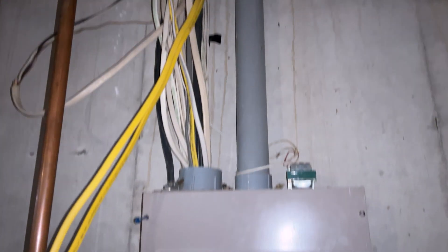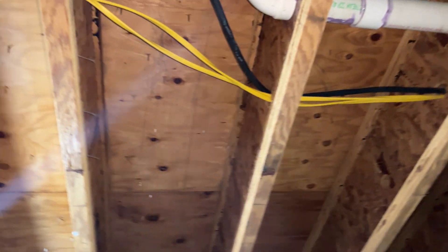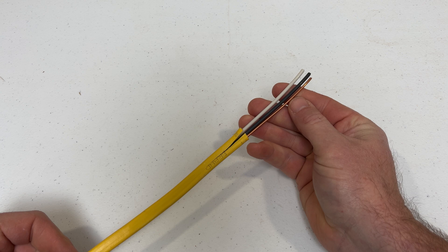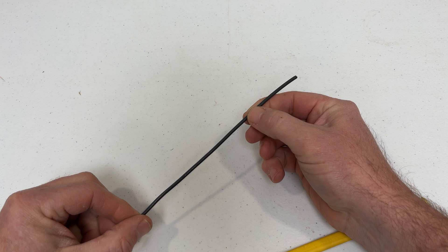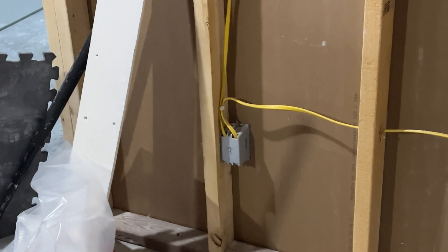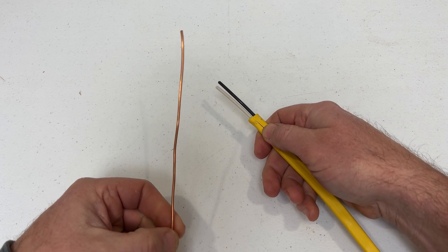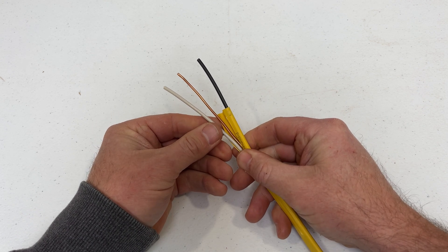Instead of a battery, the power source for my house comes in from the utility company and feeds into my breaker box for distribution throughout the house. For any one circuit — like the 20-amp circuit that'll be supplying power to the outlets in this room — a copper conducting wire supplies the power to the outlets and another copper wire completes the circuit by giving the electrons a path to return back to the electrical panel. The supply line or hot wire has black insulation around it, while the return or neutral wire has white insulation. Your home wiring looks a little different from the schematic diagram because these wires run right next to each other in one protective outer jacket — this is called Romex. A third wire called the ground wire, which isn't insulated, also comes in the Romex and it serves a protective function by giving rogue electrons a place to conduct through for safety reasons.